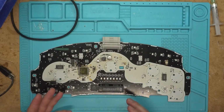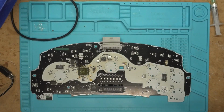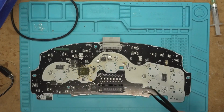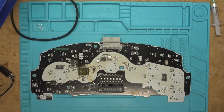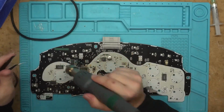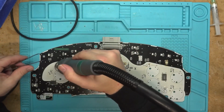Okay, so here we just have one of my old parts boards. I've had this parts board for a really long time, and I just haven't pulled any parts off it in a while. So I think what I'm going to do is just go ahead and harvest all the ICs off of here, so that I can put this in my recycling pile and send it to the electronics recycler. So let's just start pulling stuff off of here. This is at 373 with 65% airflow going on.